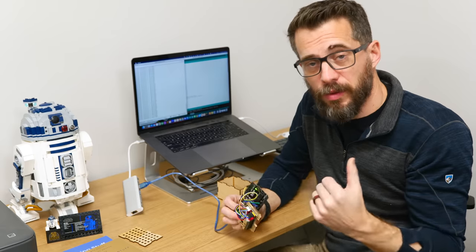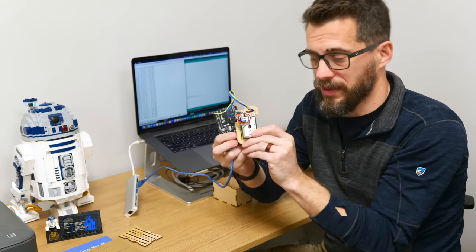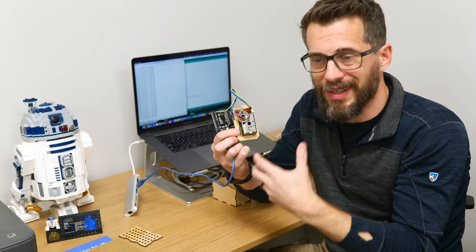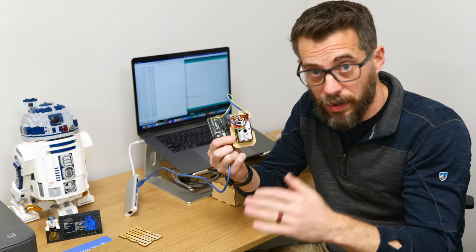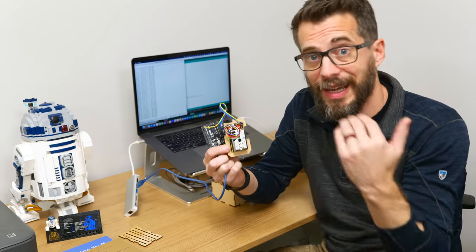The wires that are going through the wall are going to be attached to this Arduino, and so is this optical dust sensor. This has a hole in it, and inside this little box, it's actually using light to measure the cloudiness of the air. That gives us a value that we can equate to good air quality, bad air quality, whatever, and then based on those values, we can turn the LEDs different colors on the outside of the room.